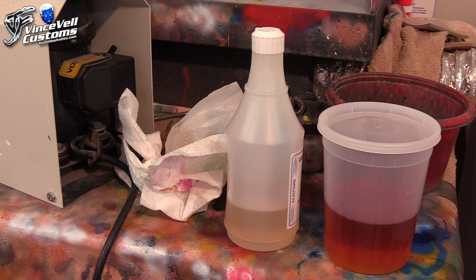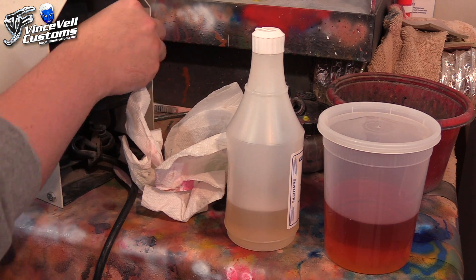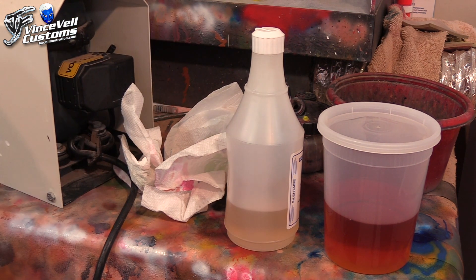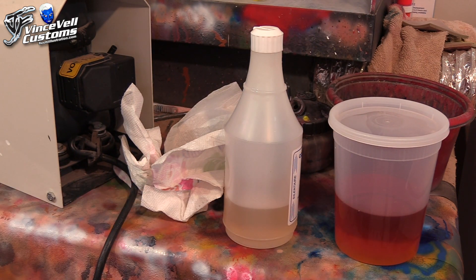Okay, so I changed the oil. I went outside, turned this upside down — there's this little pour spout with a little air filter piece that ensures airflow and keeps everything clean. You pop that off, put a hose or something there, turn this upside down, and pour out the oil. I poured out all the oil. Of course I missed a couple of times and poured some onto the grass, but that's why you do it outside. You can see this is all the nasty oil that came out. I drained it pretty well — got to the point where I really wasn't getting any drips anymore and I was shaking this thing like crazy.